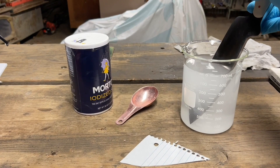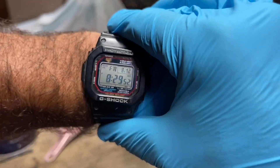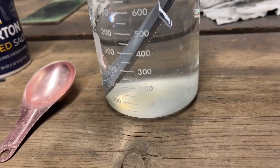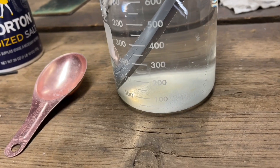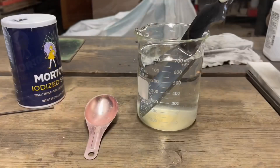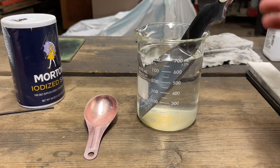I put the knife in as carefully as I could so I wouldn't mess up the tip. This test was started in the evening at 8:29 on a Friday. Coming back about 16 hours later, you can definitely see rust — but only at the bottom of the beaker. On the blade itself there's no visible rust, though there's obviously some that leached into the water and settled at the bottom. Now at about 24 hours later — Saturday evening — there is definitely rust at the bottom, but again you can't really see it on the blade itself.